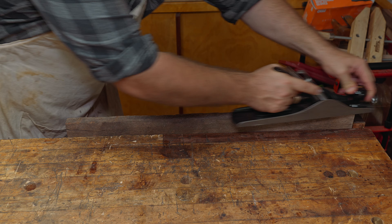I can do one more shaving — that sounded like a pretty good full length shaving; you heard the engagement right the way through and that's what you want to hear. There's a minuscule amount — a very fraction of a millimeter — slightly out, but I believe that's because I haven't actually squared this face and we're just using this face as reference. For the most part this is now square. I'm not too worried if it's out a teeny tiny amount — it would be good enough to edge joint and you're not going to have a gap, especially if you do a spring joint.